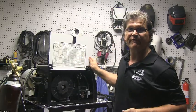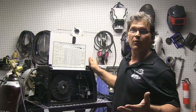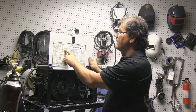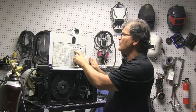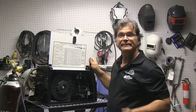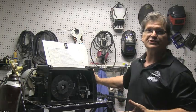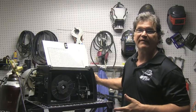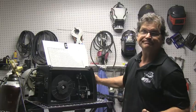Today I'm using 75/25 — 75 argon, 25 CO2 — and I'm using .030 wire, which is 0.8 millimeter wire. I can look on the chart and it gives me recommendations depending on what thickness metal I'm welding. Say if I'm welding eighth-inch thick, which is 3.2 millimeter, my settings would be 4 and 40. This machine doesn't read out actual voltage or inches per minute of wire feed speed — it just reads out arbitrary numbers, and a lot of machines are like that. The settings are a scale, a reference point, and you go from there.